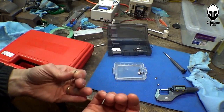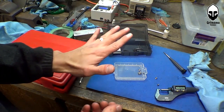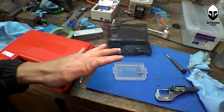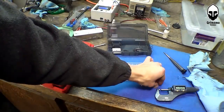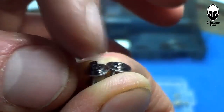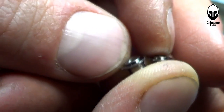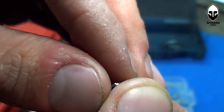So you can see the consistency of the lathe — all of these parts are within 2 tenths, which is really good; that's aerospace tolerance. Most of the shoulder diameters were a little bit low. If it's consistent I can go to the machine and bump up the tolerance a little bit so that they all average to be on target. After running one or two parts you can see that pattern, and then it works great until tool wear becomes a problem.